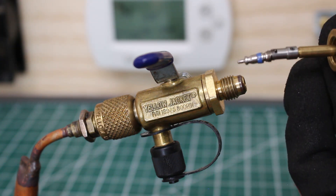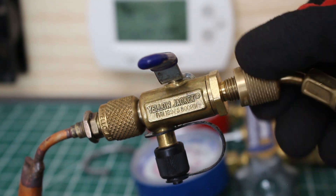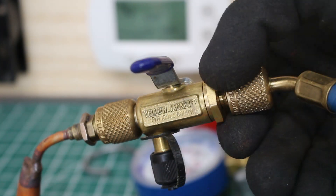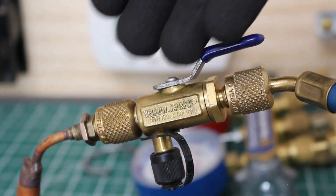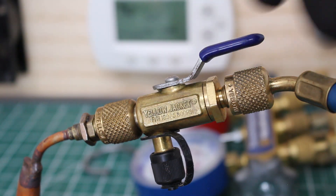Open this up and, hopefully, we have a Schrader valve in there. Sometimes you've got to do this a few times — it's not the easiest thing. And right there — now that's a beautiful thing. Now we don't have a Schrader valve in there, so now we can recover, pull vacuums, and do whatever process you want, and it's going to speed things up. We can attach our gauges, and once your gauges are connected, open back this valve and you can do whatever you'd like to the system — recover faster, pull a vacuum faster, and so forth.